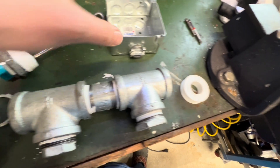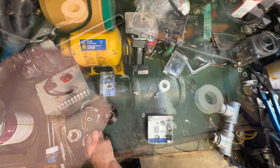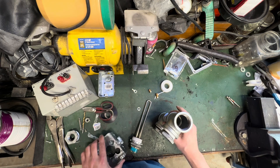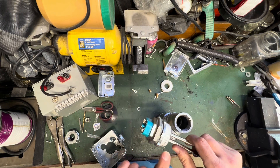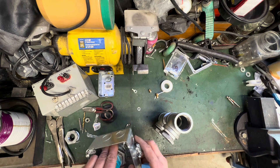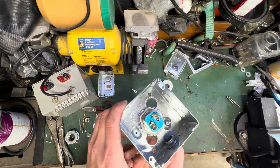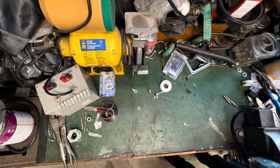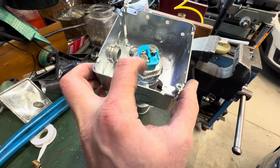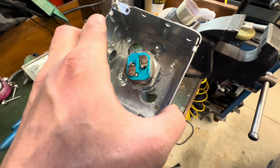Basically what we should have is an enclosed electrical compartment with the connections for the element enclosed. I have put the locking ring onto the adapter and we have our thread sealing tape. That is through there and that is how we will enclose our electrical connections for this. We have done fairly well so far — the element is enclosed in this electrical box, which turned out really nice, and the locking ring is holding it basically fixed to the heater tube.